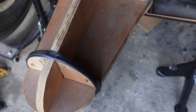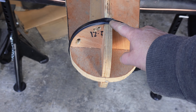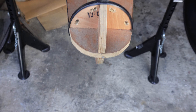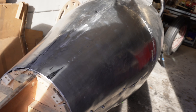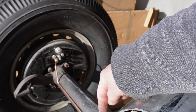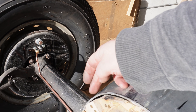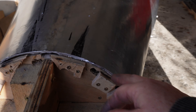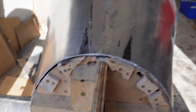I'll try two parts first with a weld down the side and then an end cap. I'll use some tape to mark it out and then very carefully cut it with the one millimetre thick cutting disc. I've put these little blocks here inset by about three millimetres so that when I test fit my aluminium panel, it gives me something to push it up against.